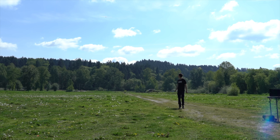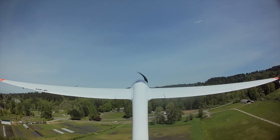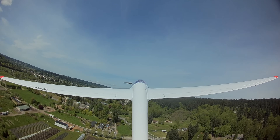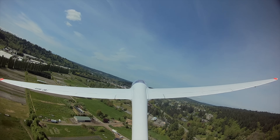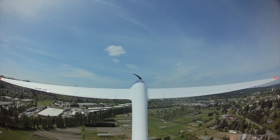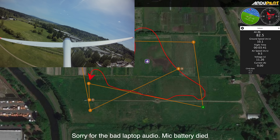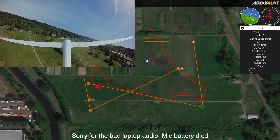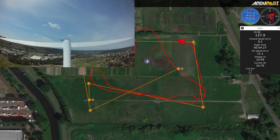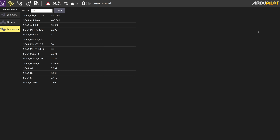Woo! Autonomous launch! So it's a few hours after I first tried to fly the plane this morning, because my Dragon Link telemetry was kind of cutting out and I wasn't able to get a very good telemetry signal with my ground control software. I switched over to the RF Design 900X modules — 900 megahertz telemetry modules — and that seems to be working much better. Okay, so now we're in mission mode. So basically my understanding of how this is supposed to work is that it follows a waypoint mission, but it never actually gets to the waypoint altitude because you're supposed to set the waypoint altitude above the soar altitude cutoff, which at that point — when it reaches 180 feet in this case — it then cuts the motor.